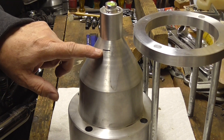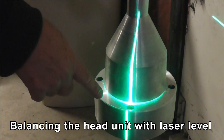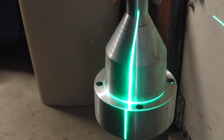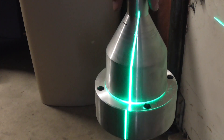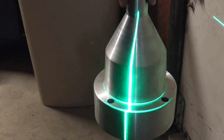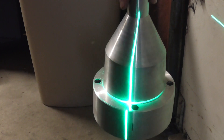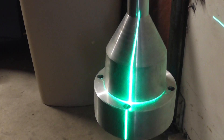If I do dial indicator measurements, I'll want to do them at this circle. I've got my laser level turned on and it's hitting mostly on the inside radius, not so much on the chamfer. I've identified this hole as number one. As I move it around you can see it's starting to light up the chamfer — quite a bit more now — and then starting to vanish as we come back to number one. So that tells me whether this is actually balancing.